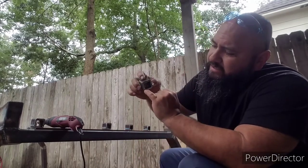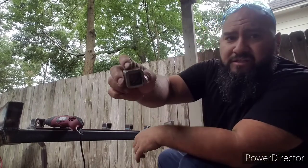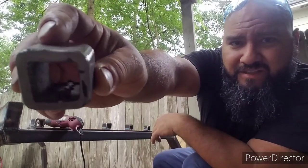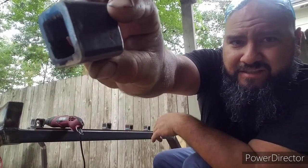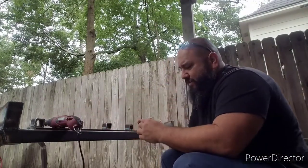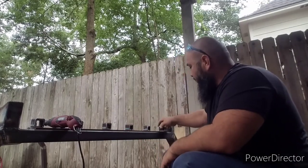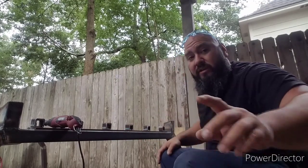What I'm going to have to do with these parts is deburr them — not only deburr but they have sharp edges. I have my rotary tool and I'm going to go ahead and go around the edges of them. These are tack-welded, so I'll go ahead and weld this one on here in a second.